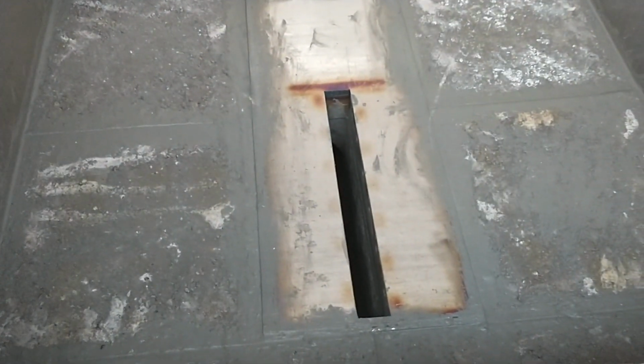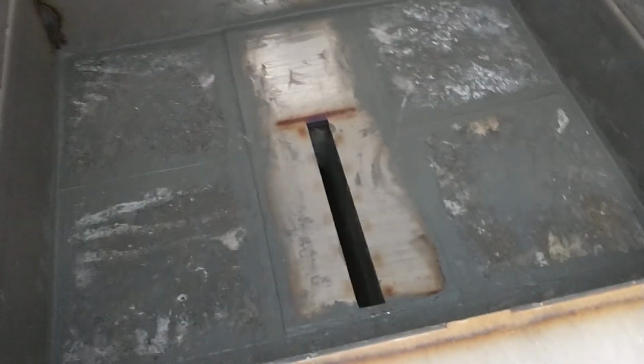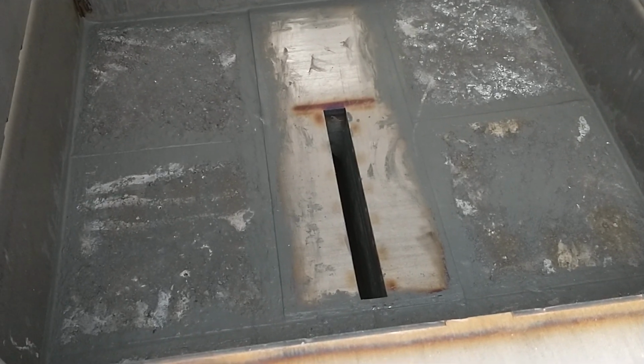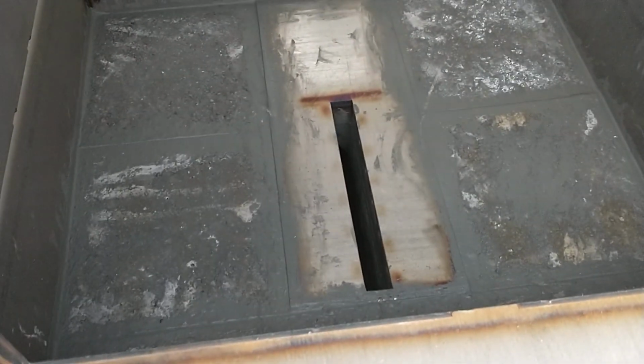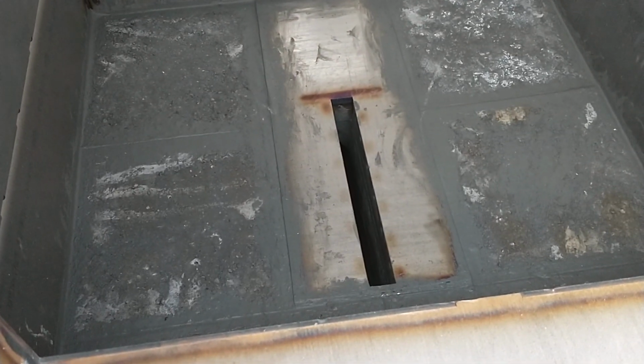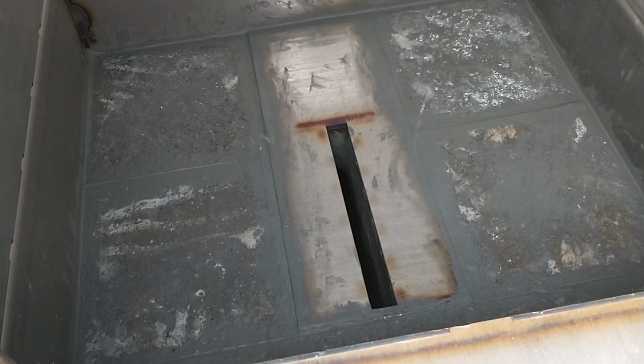Stainless steel nozzle liner. You can see the little air jets in the nozzle there. That's where it's feeding the air into your fuel air mixture as the air comes through your bottom layer of wood, down through the hot coal bed, through the nozzle. I've been really impressed with that stainless liner. It seems to hold up well. I think it's because it's air cooled, I'm not sure, but it doesn't wear back. The edge doesn't wear away like a brick edge would. Even though the brick worked well, it would slowly wear.